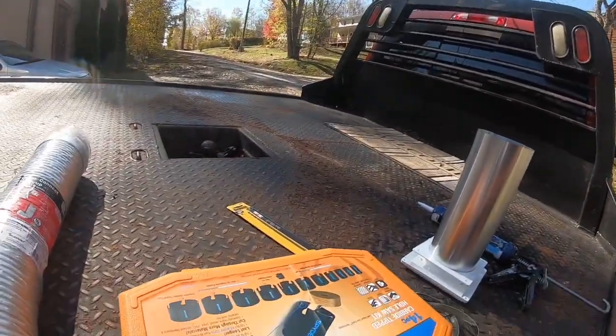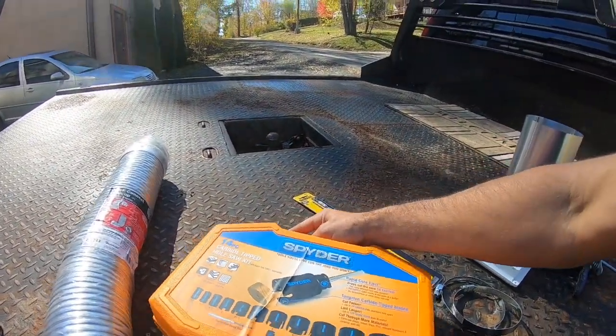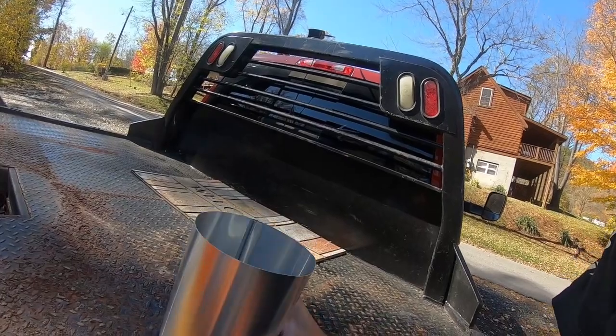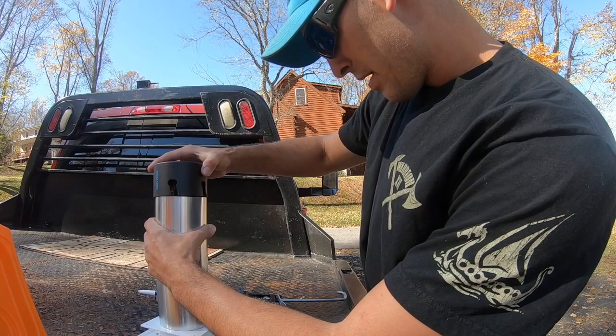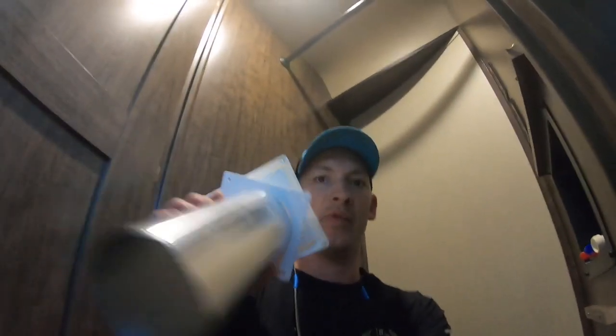I just picked up this new kit, the Spyder — you can get it at Lowe's Hardware, carbide. For this application, our pipe is going to be four and a quarter inches. So we know we need a four and a quarter inch circular drill bit for the outside. As far as where we're going to drill our pilot hole, you need to bring your sleeve inside and make sure the center line is going to line up in between your trim and your closet wall. In my instance, being that it's a four inch pipe, this was not exactly center and I had to move it over half an inch. I highly suggest bringing your pipe into your closet and making sure you don't have the same problem.